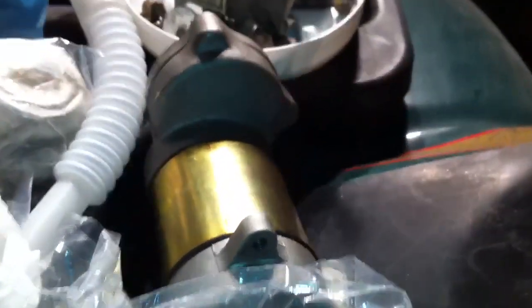My camera doesn't want to focus very well. So that's pretty much an update on this thing. It's almost 11 o'clock at night. I've got to somehow manage to get the starter back in and get everything done by morning because I'm meant to be taking this thing out. I've got the motor stripped down. I've got to change a couple of copper O-rings on that oil injection system right there because it's leaking pretty good. I break-cleaned most of it off so you can't see. I've changed the tranny oil and the counterbalancer oil — both look to be good. No water in the counterbalancer, so the water pump seal seems to be good. My brand new starter and my used but new one that failed. That's a whole kit for the front wheel bearings, so that's the next thing to do.